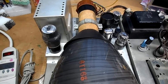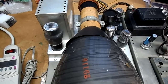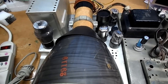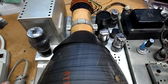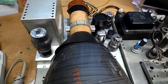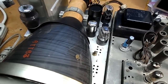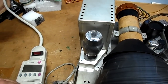It's still better than 100. Again, all 7 capacitors have been changed. That 2.2, I called it 220K as it looked red, yellow, but it's actually on the schematic. That must have been a green that's faded because it's a 2.2 meg. So reading 3 meg, it doesn't bother me. I left it in there. I may replace it in days to come. For now, we're just going to turn it on and see what it does. See if we get any more raster out of it.